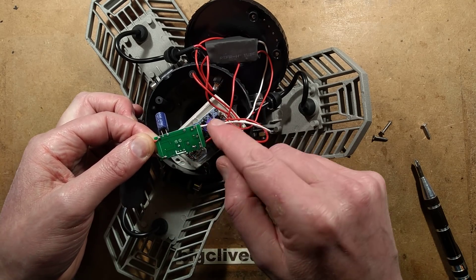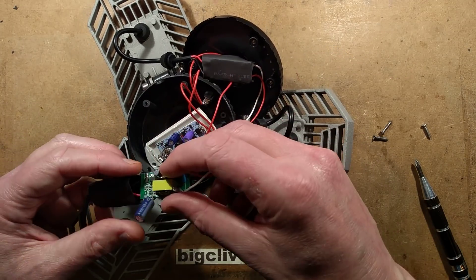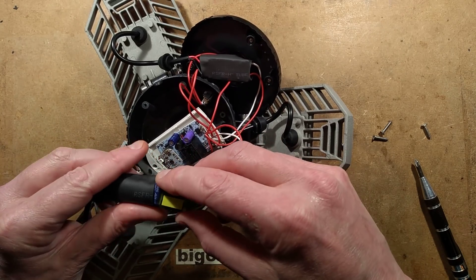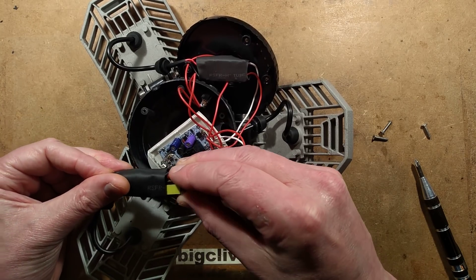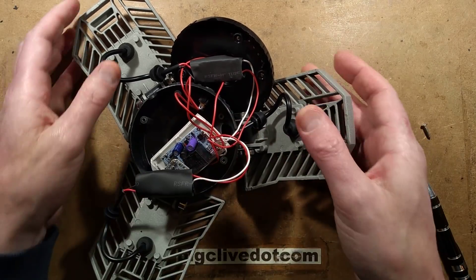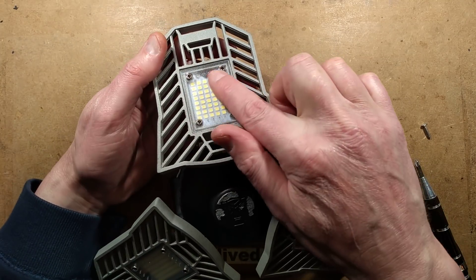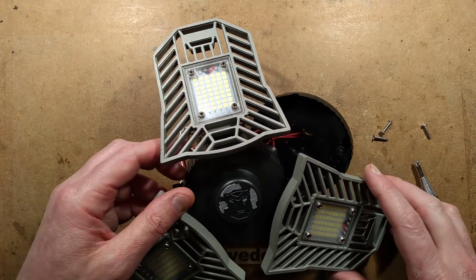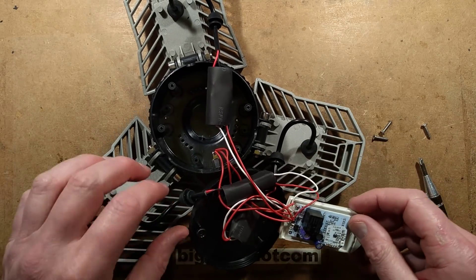No proper separation ultimately — the output is referenced to the mains. But having said that, although these are metal, as I mentioned in the previous video, it's better to treat everything as potentially being live and not handle these lights while the power's on, which is a bit awkward because you're kind of shaping and shuffling the angle of the light. You're relying on the separation of that little shim of fibreglass with the LEDs between that and the aluminium. There is always that slight risk — people have had electric shocks off similar styles of lights.